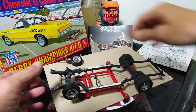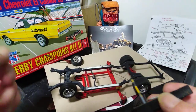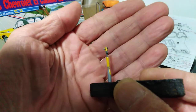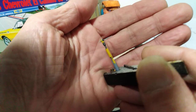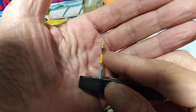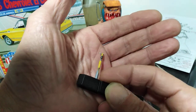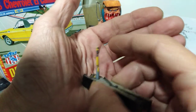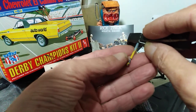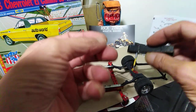I've also made a load of new scratch-built shock absorbers. This one's one of the rear shocks. As you can see, it's made from a piece of sprue, then a piece of tube — the sprue goes all the way through, then another piece of tube that I've drilled into and plugged in, and then a ring piece of tubing on top with a pin through it. That pin will go into the rear shock mounting on the back of the axle — that's the lower shock mount — and then it runs up into the body of the car.